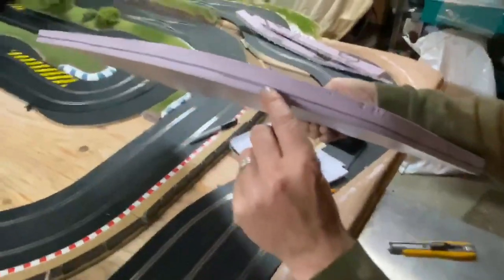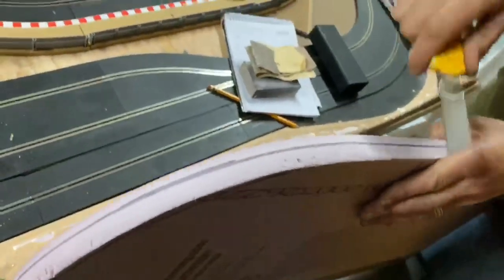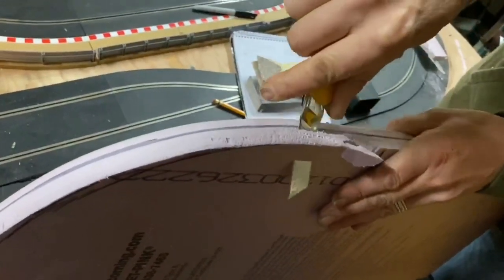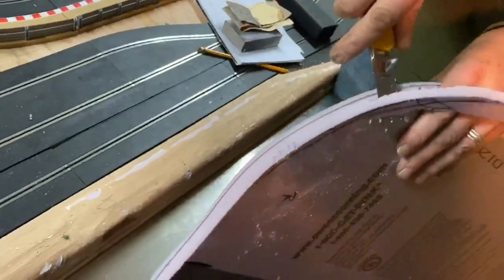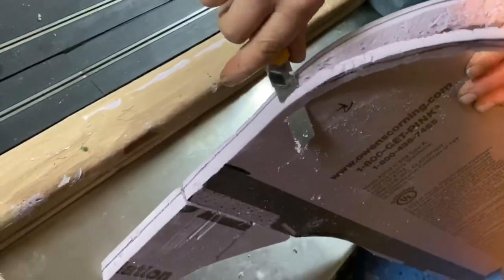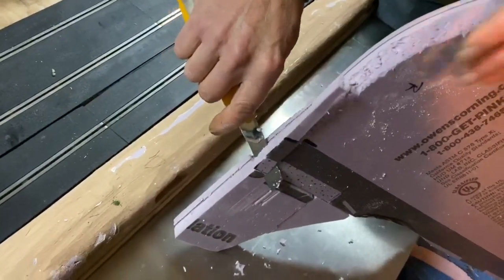Here's our board — you can see where that line's at. So instead of sitting there trying to grind down to it, I'm going to take my trusty blade and go ahead and cut on this. One thing you want to be careful with, guys — it is a razor blade so it's really sharp. So let's just go ahead and start carving down on this thing. We know where our edge is and we're just going to follow this around. It's a little bit rough, but that's okay because we'll come back with sandpaper and get it all smoothed out. This gets a good chunk of material off so we don't have to contend with it. So I'll go ahead and keep on shaping this, and when we come back, we'll start sanding.